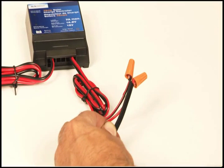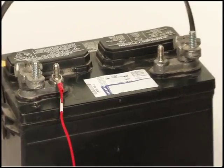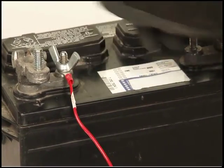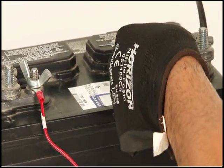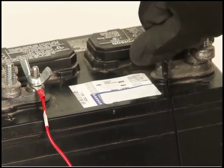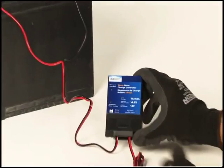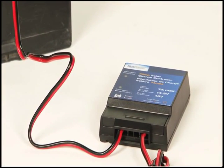Repeat the steps for the black wires. Your charge controller is now in place for battery overcharge and discharge protection. You are now able to connect the 7-amp charge controller to the 12-volt battery, which is not included in this kit. The positive red wire hooks over the positive terminal, and repeat for the negative black wire. The amber LED on the 7-amp controller should now illuminate to indicate charging.